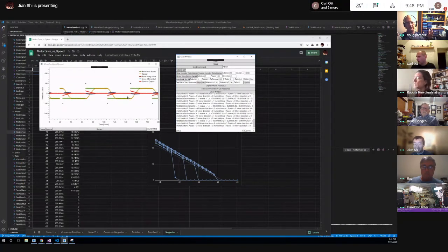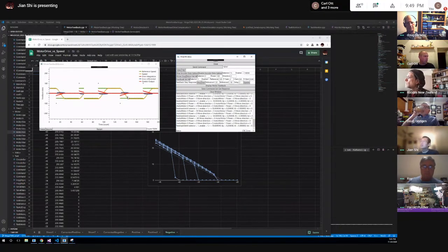I don't really worry about position so much as angle. I'm really trying to correct for angle. So the angle generates a term that modifies the reference of the two motors, so that now they're going to do what they need to do to maintain proper angle. Just knowing how far you went is just doing a summation on your encoder ticks, and when you get there, you stop.